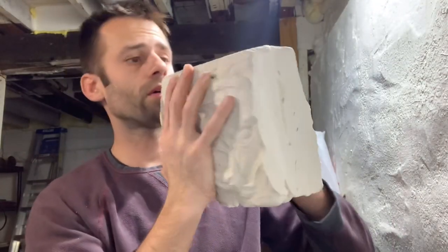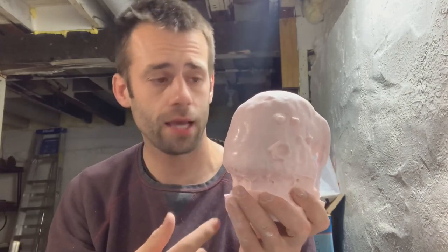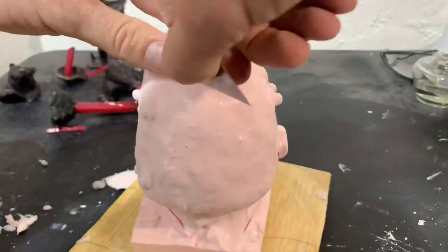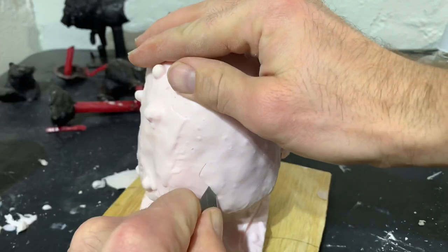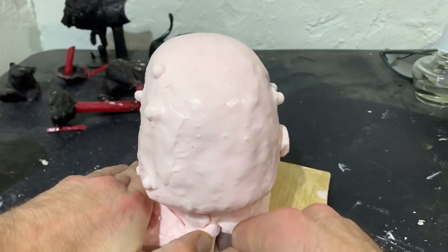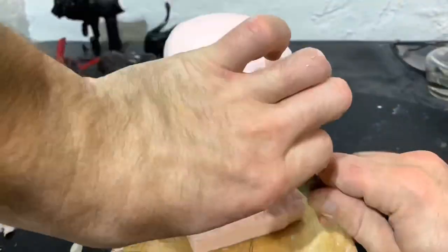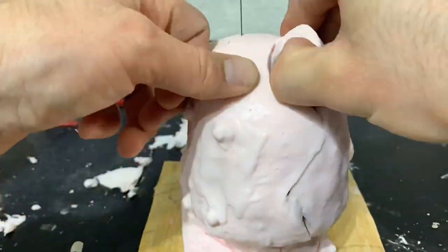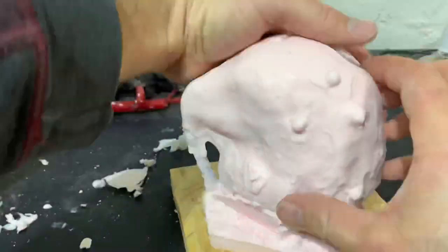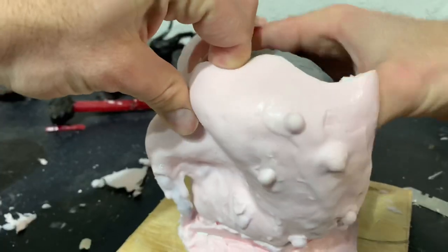I think that'll work. The last thing we've got to do is cut this thing open — I'm gonna see if I can get away with one seam along the back. I'm attempting a zigzag cut, which will help it lock in place when I put it back together. I'm also trying to weave the blade left and right to add additional angles so it locks back in place. That's another tip from Dave from Ireland — he has a new YouTube channel, so I'll put a link in the description.